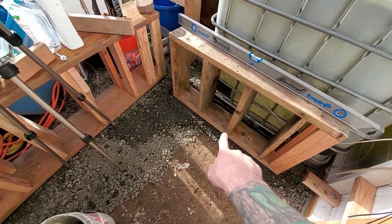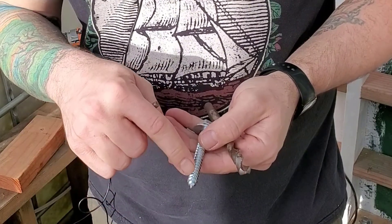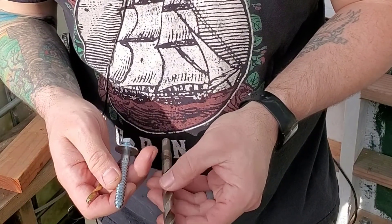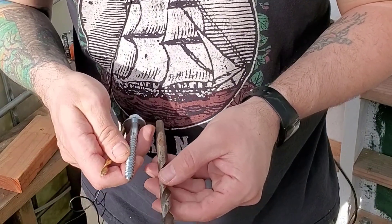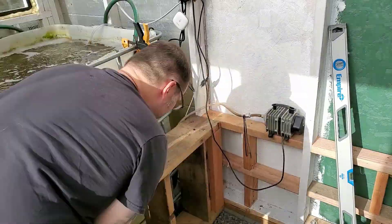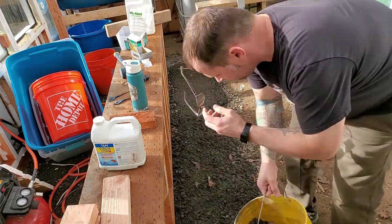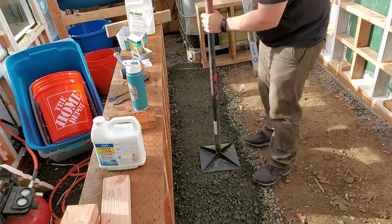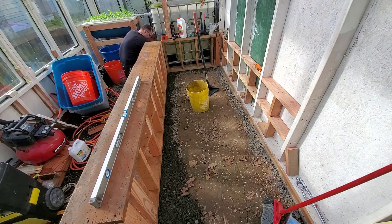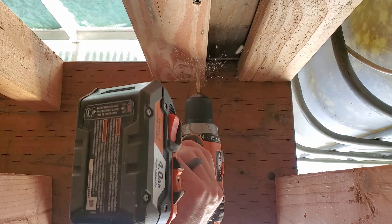I've already been leveling this gravel out. I'm going to install these lag bolts into the top part here. I'm using a drill sized for the minor diameter of the lag bolt — just slightly larger than the minor diameter — and then a clearance drill for the top plate, so it's not grabbing anything in that first plate and I'm just getting a hold of that second plate.